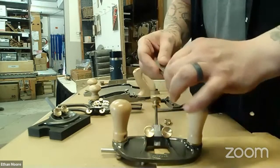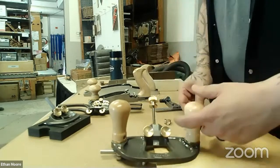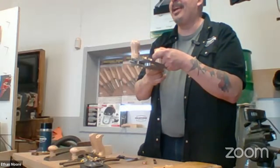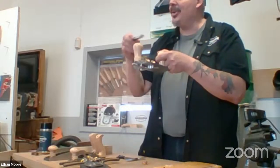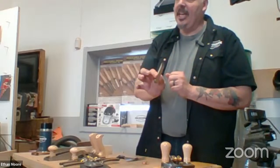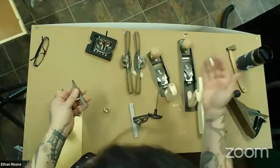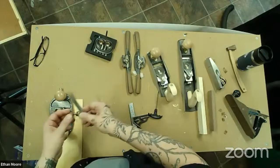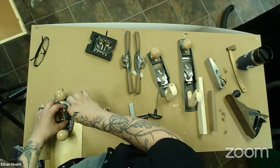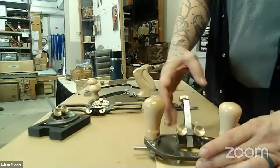In this case, what they did was realize: why can't the blade just be like a regular blade? Instead of the blade going in at 90 degrees with the cutting surface jutting out this way, why don't you just make it like a regular plane and have it bed at an angle? And it's like, oh my gosh, how awesome is that? Because now you can sharpen this blade very, very easily — whatever you use to sharpen, like a jig or a Tormek or whatever — this is no problem at all.